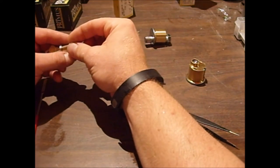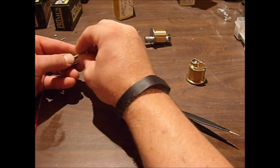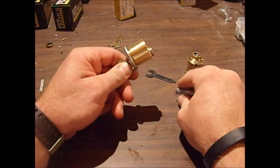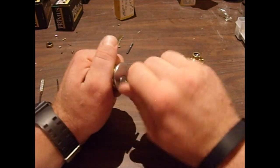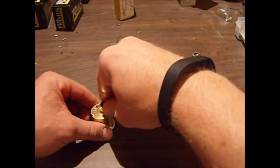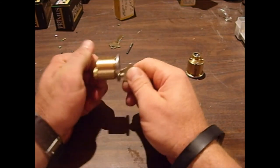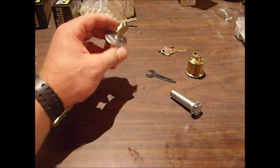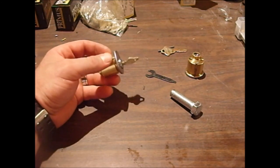You always want to try everything separately when putting this whole thing together - unless you want to have to pick it open if you made a mistake. Try your finger pins separately and your key pins separately to make sure you're not going to end up with a big mess. Put your key pins in, put it in, make sure it turns, make sure your shear line is nice and smooth. Then you can put your sidebar springs in the little recess, put your sidebar in, and check that the sidebar sits flush with the plug. Give it a try - and there it's working, barely. It needs to be loosened up a little bit. Now you can hear that clicking - that's the sidebar.